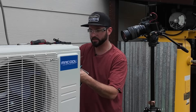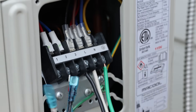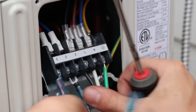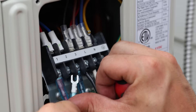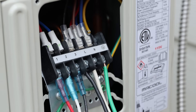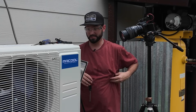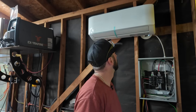We have these three bits here — this green line we can run to the little green screw. Then you'll notice that this has colors and numbers, so this cord here we're going to put under the one labeled black, and one says three so we'll put that under three, and this white says two. Now we've got everything wired in, we're going to clean up this panel a little bit and screw it back on, and then I think we can turn it all on and see if it works — fingers crossed.